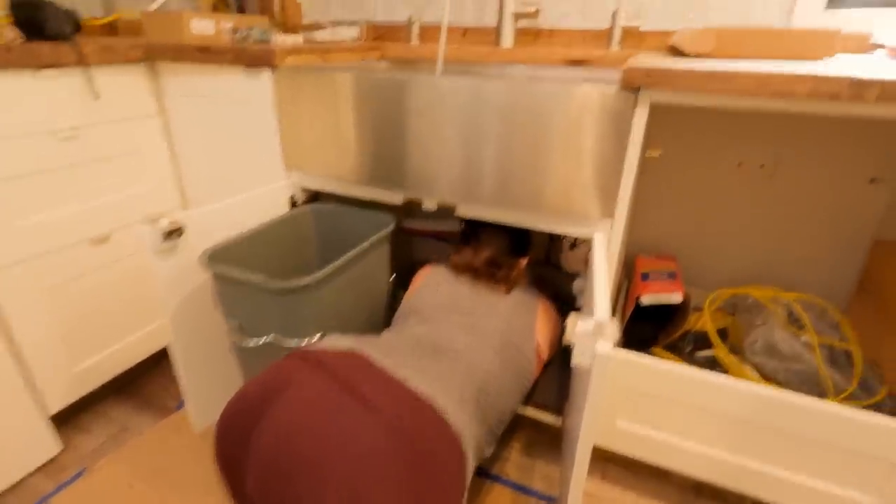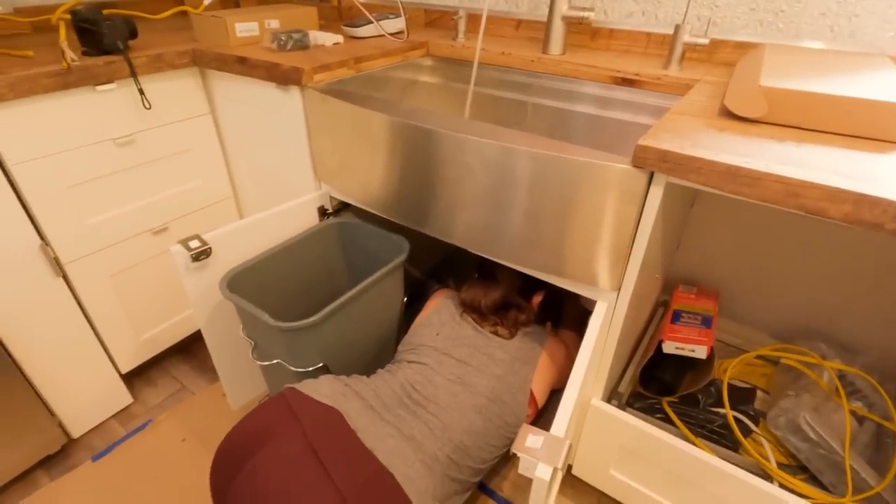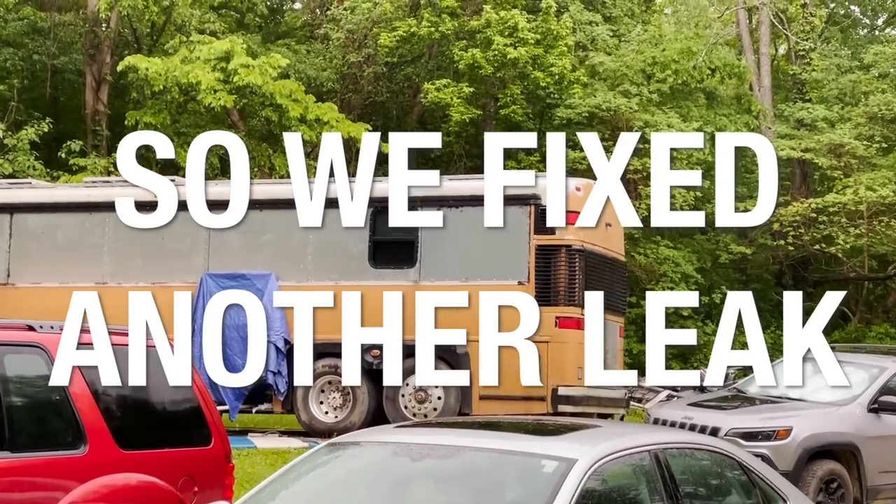Our cold water supply to our Aquiva looks good — no water spurting out of it. Now we'll rinse water into the sink. There's a drip. I watched a video a while back that said plumber's putty was the best thing to use in a moving vehicle, but everywhere I've found leaks it's been plumber's putty. When I remove it and put tape on, my leak is suddenly gone. That means all of our cold water in the bathroom and the kitchen is working with no leaks.